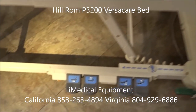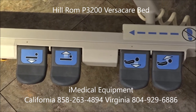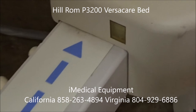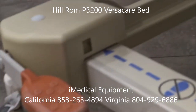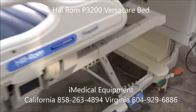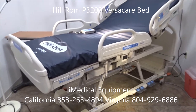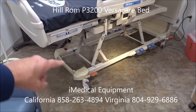Down here you have a set of kick pedals, which allows you to activate and use the bed with your feet to free your arms up if you're taking care of the patient and you need your arms free. The bed also has a small glass window that shoots a laser directly across to the other side. If anything gets in between that laser, it's going to stop the bed from moving and lock it — it won't allow the bed to go up and down. So if you have an issue with the bed not going up and down, more than likely something has gone in front of that laser, which runs across the length of the bed.